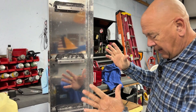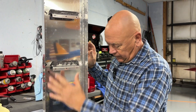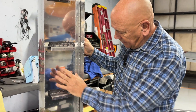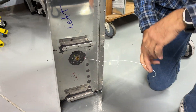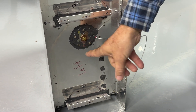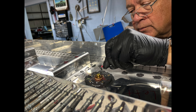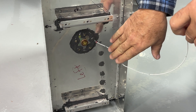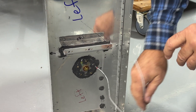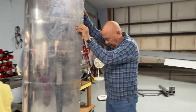Overnight I had this setting laying down, so hopefully we got some gravity work of the sealant to lay against the inside of the baffle to seal the edge. One of the tricks I recommend is to always add a ground wire to the sender. The sender should pick up ground through the screws, but by adding this ground wire I've always had really accurate and unwavering fuel quantity indications. I've added a ground wire here on one of the screws, and also on the other sender at the root side.